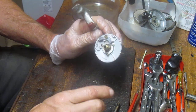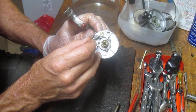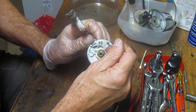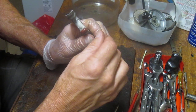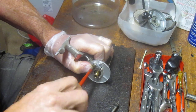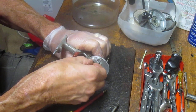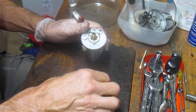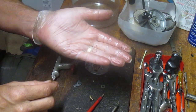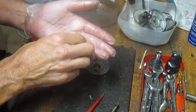The second one is a longer spring — it's a coil spring. It wraps to the back of the dog, comes underneath, there's a coil here, and it comes out and sits under this little stud on the side plate. In order to get that reset, typically what you want to do is pull the screw out. We'll pull that out now and give you a better look. That's probably what happened here — it just kind of jumped like that.